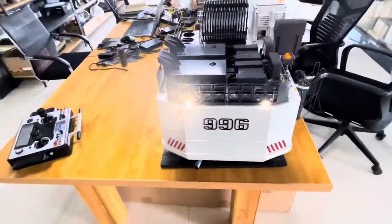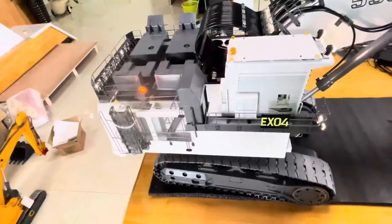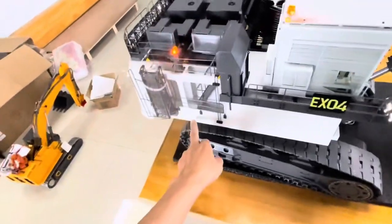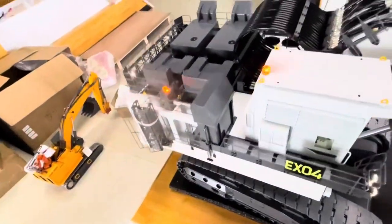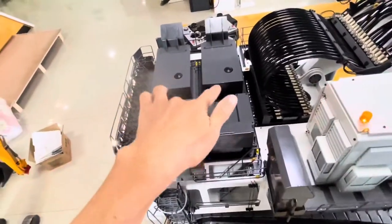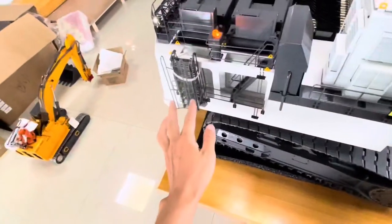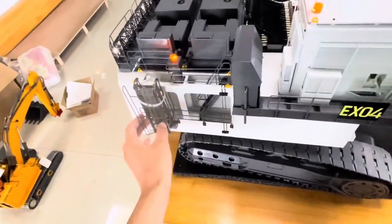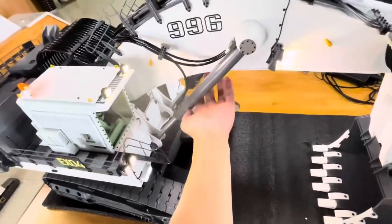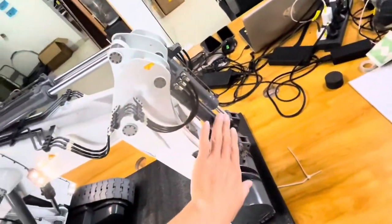See the back side — the light. See here, this one is the ladder for the driver to climb on, and this is also controlled by the hydraulic system. We got four hydraulic oil pumps assembled in two blocks — each block has two hydraulic oil pumps. This ladder is controlled by one hydraulic oil pump. The boom and big arm cylinders are controlled by one hydraulic pump, these two by one pump, and these two by another pump.